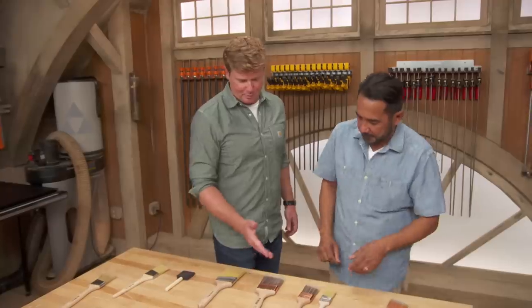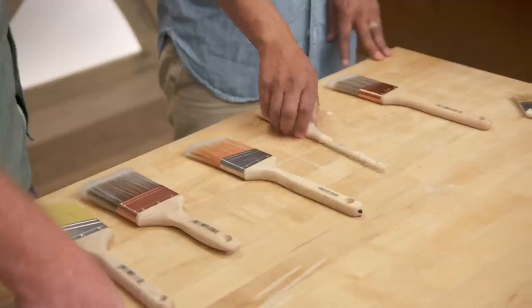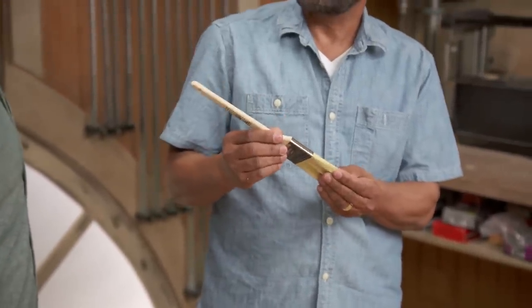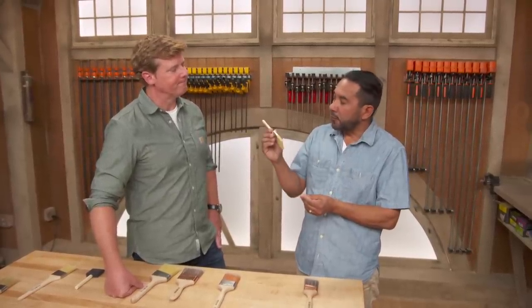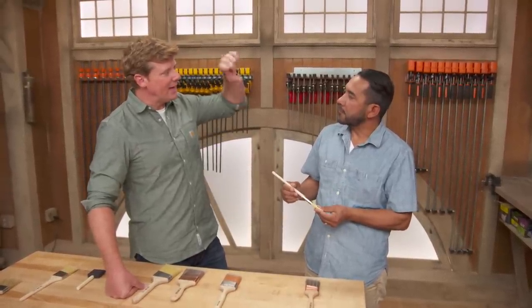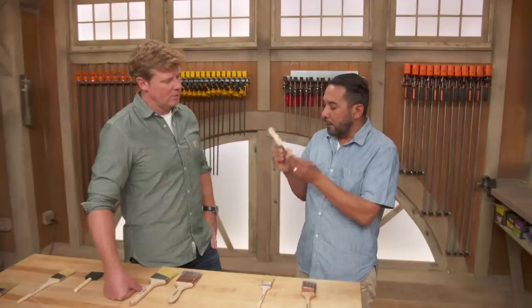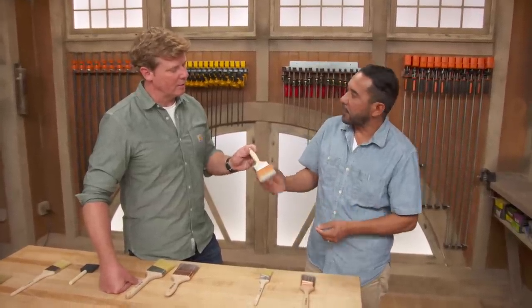Material, shape — what about size? Because they come in a whole bunch of different sizes. You always try to match the size of a brush with the surface you're trying to paint. Something like this is going to be used where? Let's say you paint a window sash — this will do the work for you. You've got the little wood muntins, so you're going to go with an inch and a half sash brush. And if you're going to do the casings around the window, the trim, the baseboard? The two-and-a-half-inch is the best — that's the one to go for.